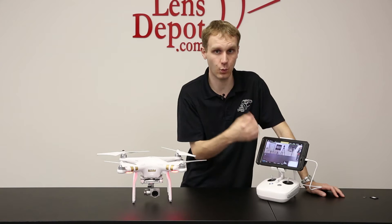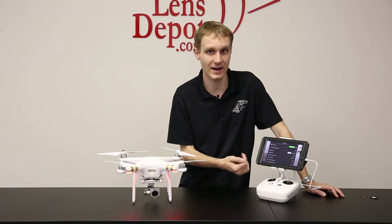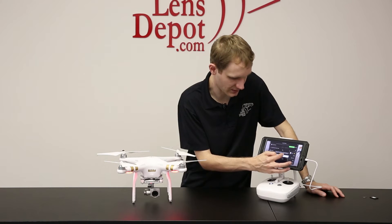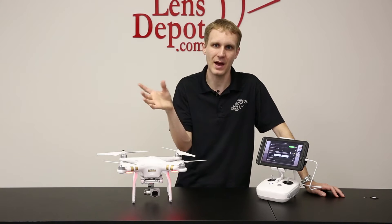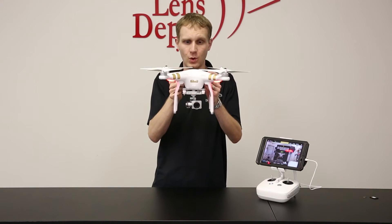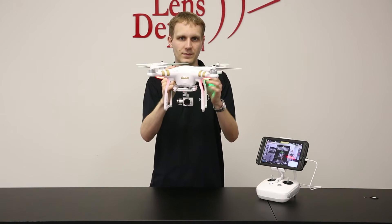This will turn green once you're all connected. I'm going to show you how to set the compass. You'll press that — this will bring up all of the status options for the Phantom. Then we're going to hit calibrate. Once we hit calibrate, it asks you to be sure to set the compass and that you're not in an area where there'd be any interference — any kind of metal or inside of a building. So we'll hit okay. First thing you're going to want to do — and the app will tell you this — you want to rotate the unit horizontally until the back lights light up green. And there we go.